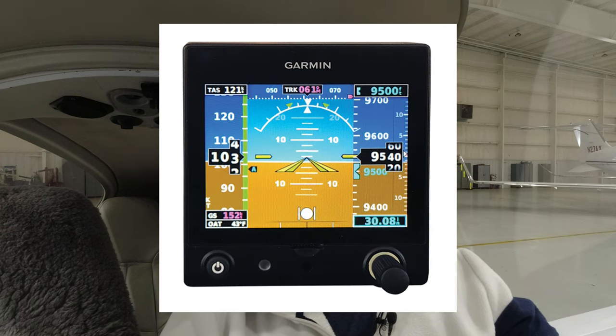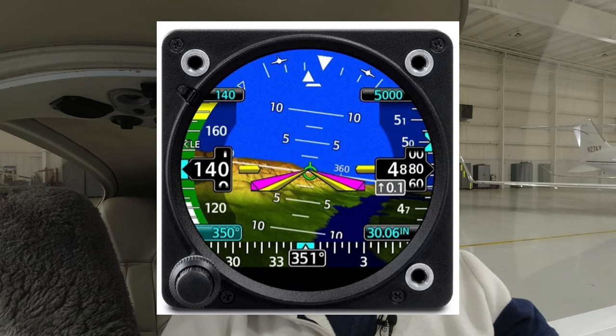While that boots, I was looking at several units to choose from. The Garmin G5 was immediately ruled out — it's not approved to be paired with the G1000 for whatever reason, software or electronics. Then I looked at the Garmin GI 275. That unit does more than I really needed, but the price wasn't bad — around $3,000–$4,000. The problem was the installation: a lot of labor, sensors, wiring, and even a possible glare shield modification because of depth. I've seen installs on Diamond aircraft in the $7,000 range, which was way more than I wanted to spend on a backup unit.